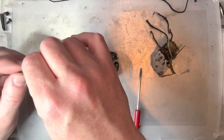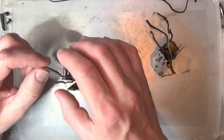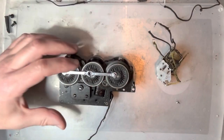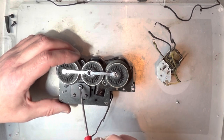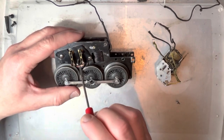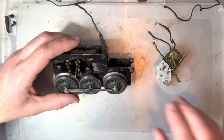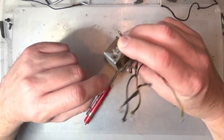This is just a set of heat shrink tubing I picked up off Amazon. I'm not going to shrink it on there — I'm just going to slide it over for a little bit of additional protection for the wire. So now if it rubs on anything it should be okay. This motor is not very different from others. You can take two screws to get the plate off on this side to clean the end and lubricate it, and you can take these two screws out to get the brush plate off. I've already done that and cleaned the armature, cleaned the brushes and everything, so I'm going to leave that together now. I do have other videos where I delve into that more deeply. While I've got it apart, I'm going to check out the E-Unit — one thing to do while it's out is to check for free movement of the parts.